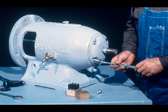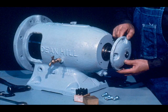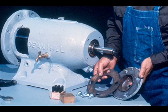The workman may now remove the cap screws from the bearing cover, and the bearing cover itself from the bearing housing. Be sure to save the old gasket — you'll need it as reference in obtaining a new gasket.